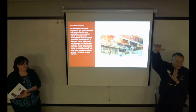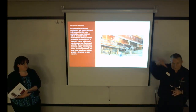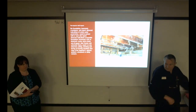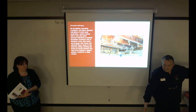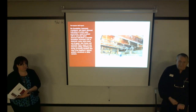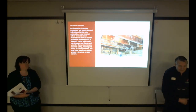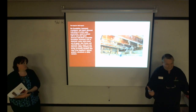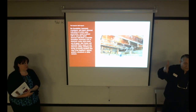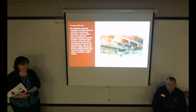Don't be so afraid of those cracks up there. Let your inspector tell you whether he thinks you ought to have them checked out. Don't just say 'some guy named Al said they don't mean anything' — most of them don't, but some do. Some of those cracks are still moving. A lot of them won't ever move again; they've gone as far as they're going to go.